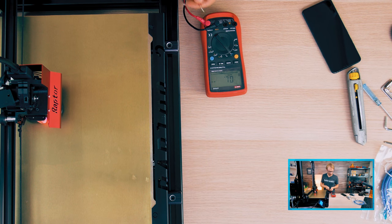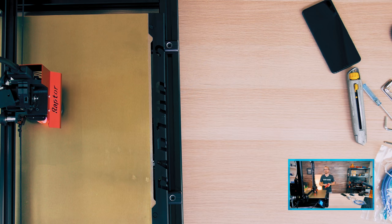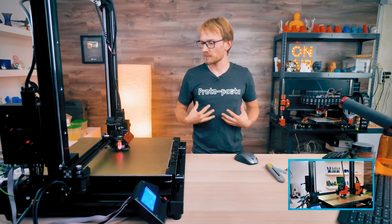I'm going to go over to resistance here and check between some ground. I'll use the ground over here and the frame, and 85 ohms on the x-axis. 1 ohm on the frame, so that's good. So the x-axis does have some resistance somewhere. Stefan is here. Hey, man. Cool. So the frame is grounded and I should be safe.